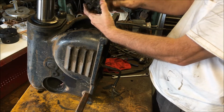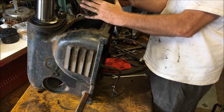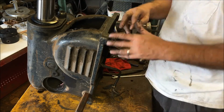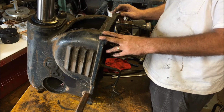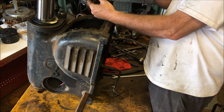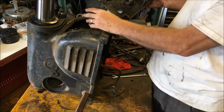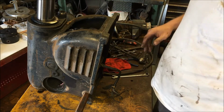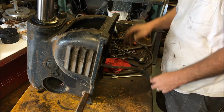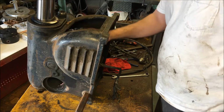This is the old shut-off switch for when they had a special switch here that had a pin in it, and that pin was part of the tooling that went to use a shoe grinder or a brake drum hard spot grinding tool. So they had a pin that was tapered that went in here, and when you pulled out the tool that held the drum grinding, hard spot grinding tool, you couldn't turn on the machine, because if you turned on the machine while the grinding tool fixture was on there, it would break something. Either it would destroy the brake tool or it would shear off something internally in the machine. So that was a safety switch. It wasn't really any kind of relay or anything. It was just a safety to shut it off.